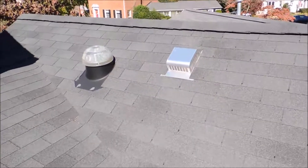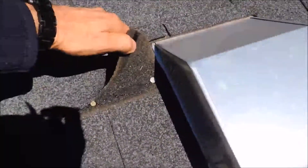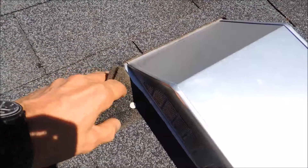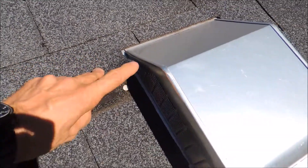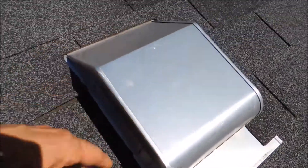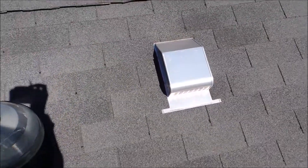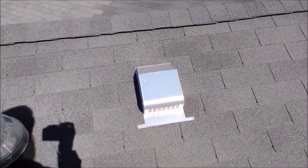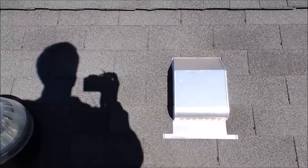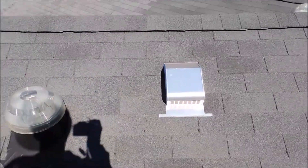Now let's check out these two. Here's another one — when you nail your shingles into place you should nail away from the flashing. Also there was no ice and water shield installed underneath this vent, so what we'll do is remove all the roofing material around this vent and also the pipe flange, then we're going to install ice and water shield which will be fully adhered to the flashing, and then we'll re-shingle it.